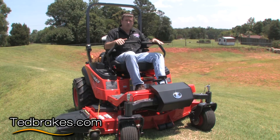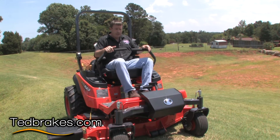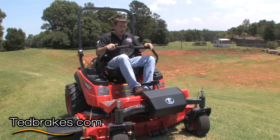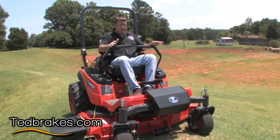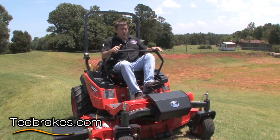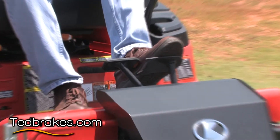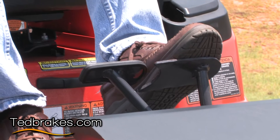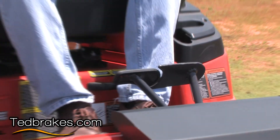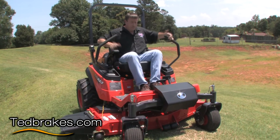On this particular mower we have added the Ted Brake, which is this pedal here, and we've got it in the park position. We're going to knock it off the park position and then you can use the front and the back brakes together, or you can just use the front brake as you're going down a hill to control your traction and control with the rear wheels. We'll be showing both of these in action and explaining why we wanted the front brakes.